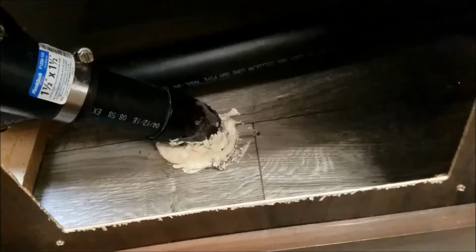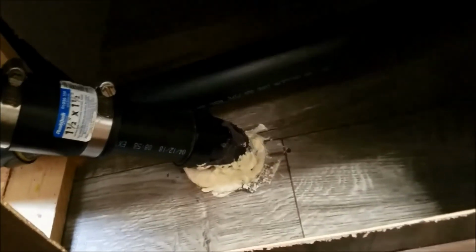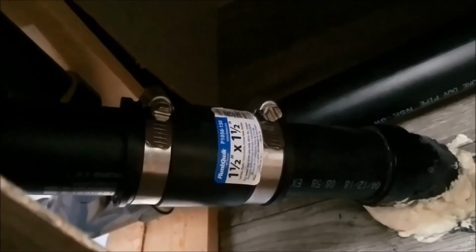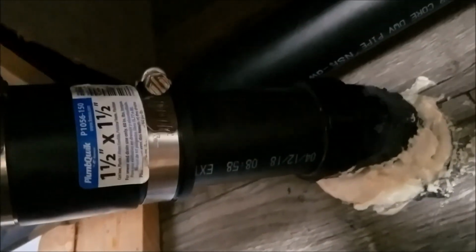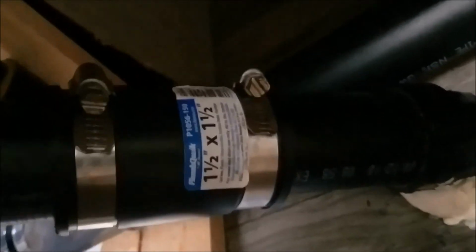So the black tank vent, since no liquid goes down into it, I cut the pipe, got a splicing coupler there, a rubber coupler, but instead of pulling the thing out and notching it, I just lifted it until the flange at the bottom was tight against the seal. Then I cut a little off the pipe to make room for it to attach to the old one, the other end. Cut about 3/4 of an inch off in my case, put the coupler on, and pulled up tight again before I tightened it.